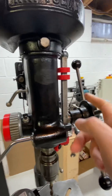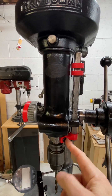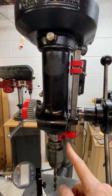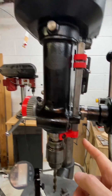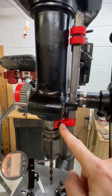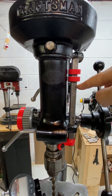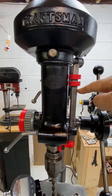I ordered the new quill stop on eBay as well as the feed stop. It came with a bracket, but the bracket was for the 15-inch later model, so I was missing the right bracket. They're hard to find, so I designed one in Fusion 360 and 3D printed it, along with the bolts — because these bolts are an Acme 11 threads per inch, which is kind of odd.